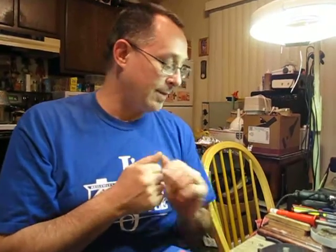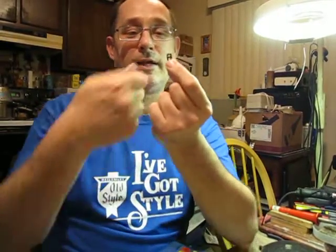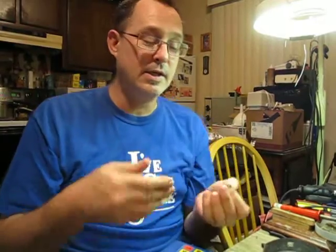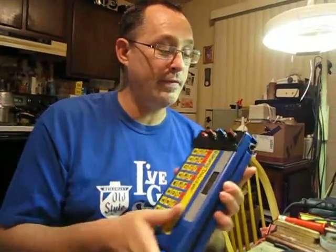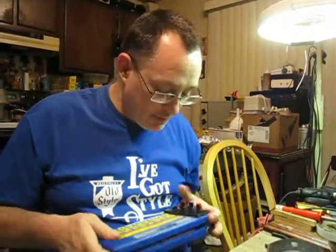The talking stuff is really the best stuff. I mean, if it just plays a song or does music, there typically will be a clock. There'll be either a fixed resistor or a trimmer pot. This is the trimmer pot you can adjust, and if you were to turn that, it would raise or lower the pitch of the gentleman that speaks. So yeah, that was the first thing to go. The trimmer got pulled out and I cut in this pot so you can adjust the speed. And then this here is long glitch, and this is long unstable glitch, and this is short glitch.